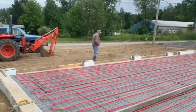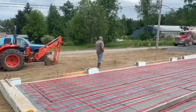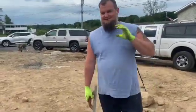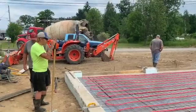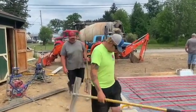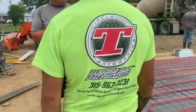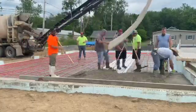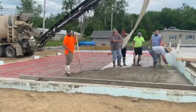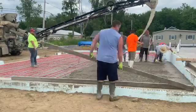Back them right in there Greg, right down the center. So we're pouring out this slab here. I showed you how we put the pins in there — we put some grade stakes with some screws in them at our grade and we're using that to set our grade because this floor has a two and a half inch pitch from the back to the front so the water runs out the front. We did not put a trench drain in this one.